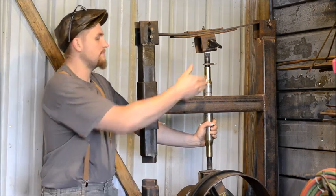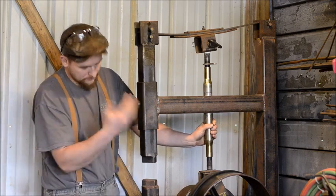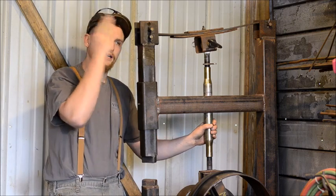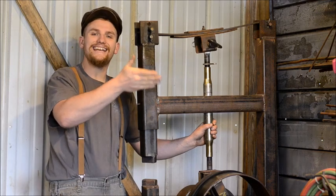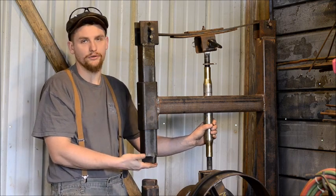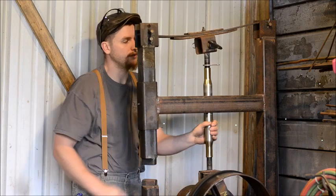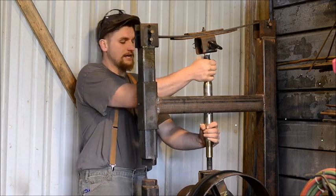Some of the advantages of this being a mechanical helved hammer are several things. One, since it is a guided helve, it keeps the stroke right in line. Whereas a regular helve hammer can come down, and depending on where you're at in that stroke, it's hitting your material at an angle. Whereas this always keeps it straight up and down and hitting your material squarely. It uses some pretty handy features like a tractor top link here to have the adjustability so you can work whatever size stock you want with top tooling and things. And then you can just lock that thing in.